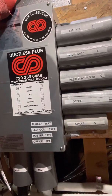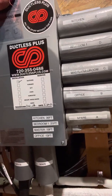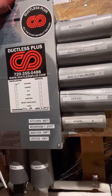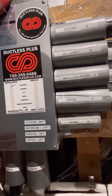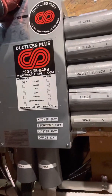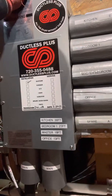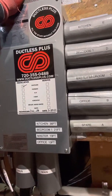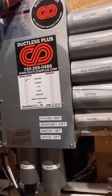You should also do a very detailed pressure test. We're going to fill this machine up to 600-plus PSI on the nitrogen side, leave it under pressure for 24 hours, come back the next day and check it. If that thing hasn't moved or budged, we know that we're sitting pretty. Remember that nitrogen is an inert gas — it's not going to expand from temperatures; it's going to stay at that pressure. So it's a good gas to use when you're doing your pressure test.